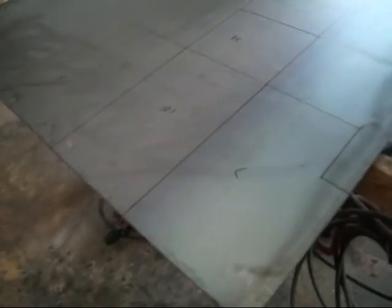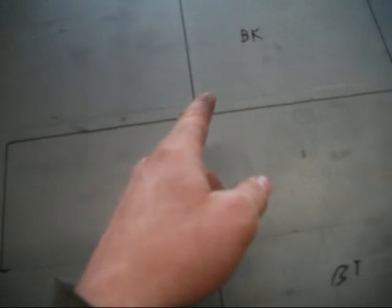And so I got a piece of 1/8 inch sheet metal. I've kind of laid out what I got sketched up here for a design. And if my memory serves me correctly, a cubic foot is 7.48 gallons. And according to my math, this thing should hold just under 6 gallons, which will be a considerable improvement over the old one. So I'm going to cut out the outline.